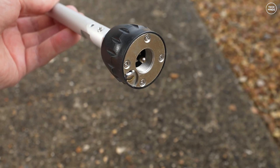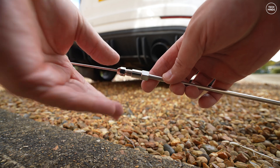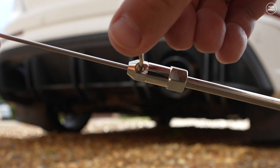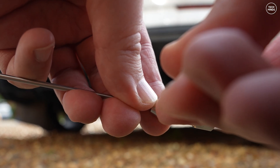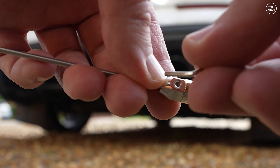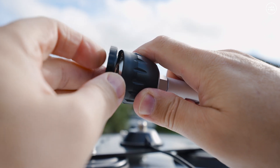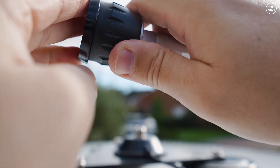We'll attach the antenna to a Radio Oddity M916 heavy duty magnetic base. The top section just screws into the middle section — make sure it's as tight as possible so it doesn't come apart. There's also a grub screw on this part used to loosen or tighten the top section, which you move up and down for tuning. Note that you cannot cover 25 to 30 megahertz simultaneously. The rubber seal included in the box attaches here to prevent water ingress between the antenna base and your vehicle mount.